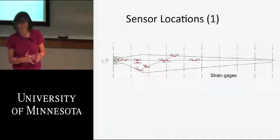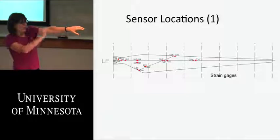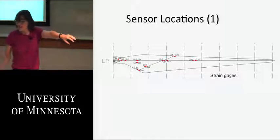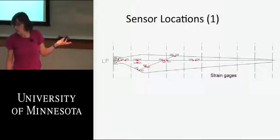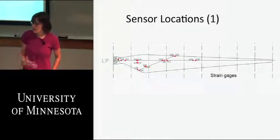It's really cool. It's a really interesting technology because, you can imagine, if the fiber is going all the way along, they've just cleared out different spots all the way along, and each one has its own unique frequency. So that's how they can get like 10 or 100. I mean, if you talk to the guys who make those fiber optic strain gauges, they said they can get like 100 off of one line. But I think we only have about 10. So at any rate, strain gauges are kind of crude at this point when you think about that.